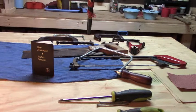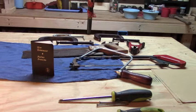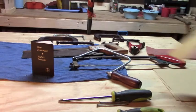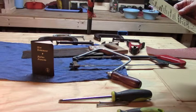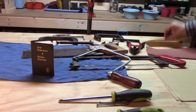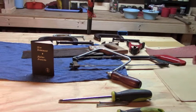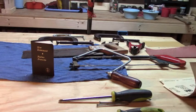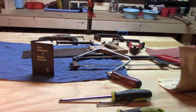I also have different kinds of sandpapers here. It's kind of interesting that when you pick up sandpaper in a store, the lower the number, the heavier the grit. If you have a brand new project that you want to sand, you might want to start out with the heaviest first, like a 50 or an 80 grade. Then work your way up to 100, maybe 120, 150, and then a 220.